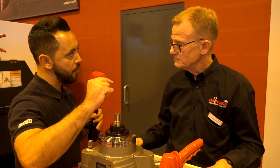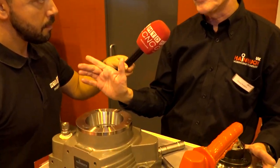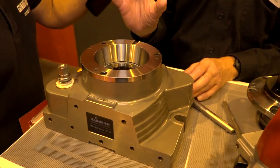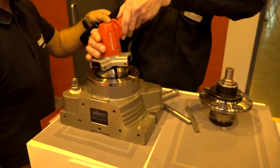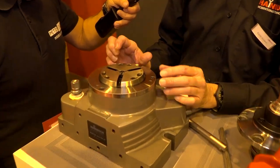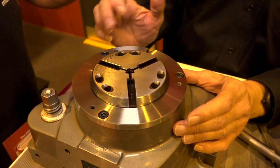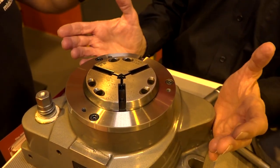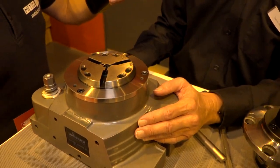What's the minimum depth that you need to hold to be able to clamp it securely? On our chuck — and it applies not just to the manual chuck but to the chucks that we put on the turning machines — it's a minimum of three millimetres but from the front of the chuck. Once the collet is in, we're not talking three millimetres from the front here because clearly this is outside the chuck. So three millimetres from the front of the chuck, preferably to an end stop which you can put in the Manok Plus, and you can hold on three millimetres without it spitting it out.